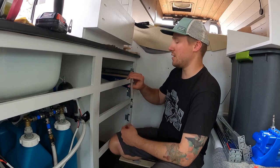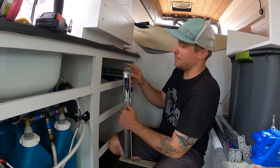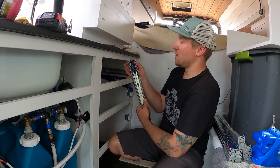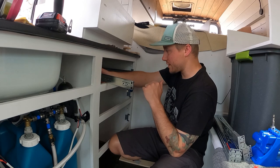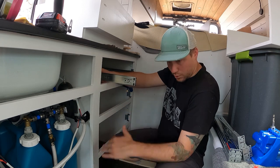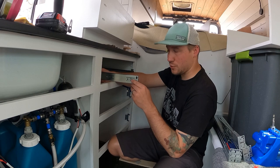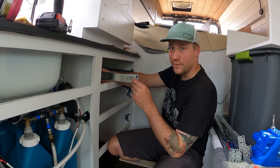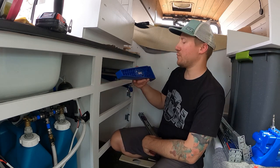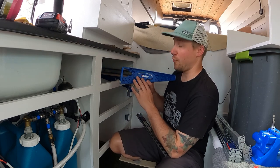Now we're going to go ahead and see about getting the drawer slides installed. The first thing is clipping on the back anchors — they have that two inches of play. You want to make sure everything is square, and obviously in a van because the van is slanted and on grass in my backyard, the floor slopes down a little bit. It makes it pretty difficult to get things square, as many of you probably know having built out your own van. One of the things for drawer slides to be able to get them in squarely is this Kreg jig for drawer slides.